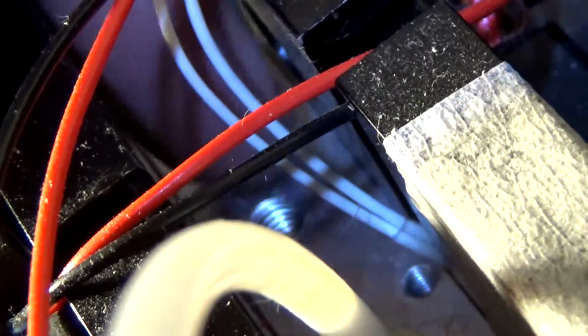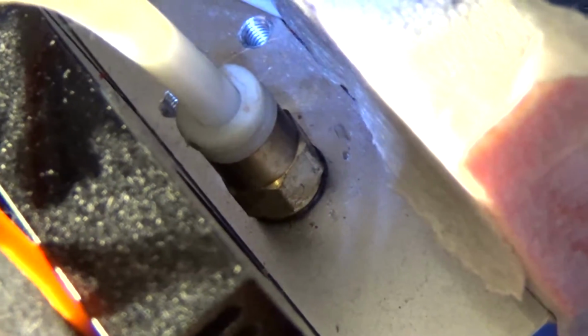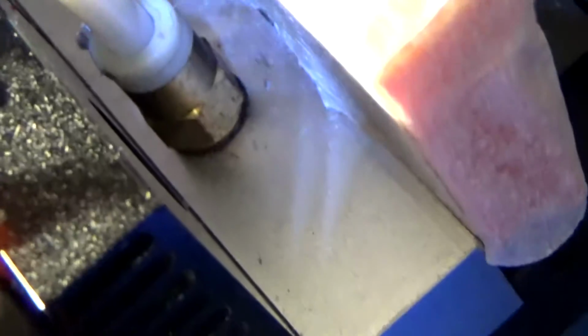it's hard to see, but that little dude right there, that one actually is a smaller thread because it's meant to thread into the same hole right over here. I believe it's M5 or M6, I don't remember. But it's the same thread as the threaded tube for the extruder. And it just goes right into there, threads all the way in, and then the threaded tube for the actual hot end itself just butts up right into it, and boom, there you go.